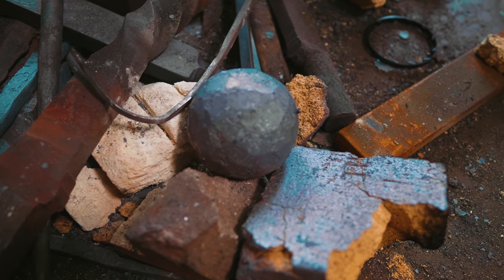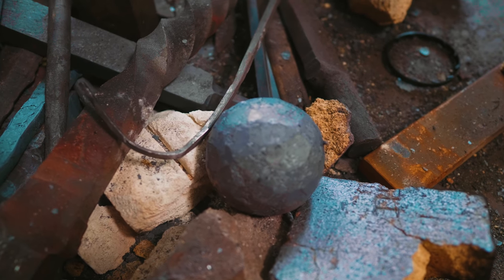So we've got our gigantic ball forged. It's about 4.5 pounds. It happens to be 1040 steel, but of course I don't think that particularly matters for this object. I just happen to have a lot of the material hanging around from the good old hammer making days. Now, we need to start thinking about some of the other parts of the flail.